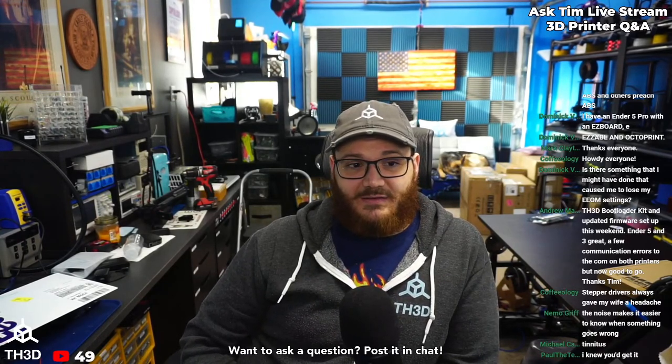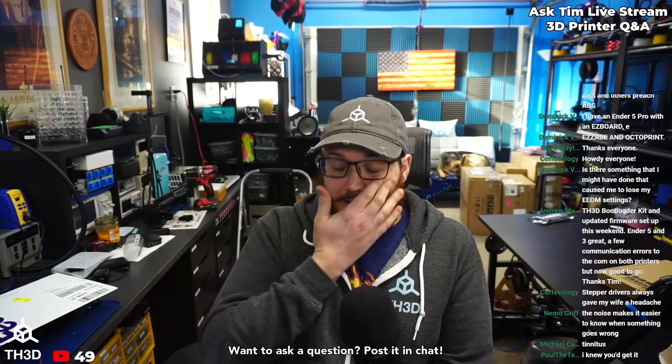V-Rich says, are 100K thermistors good for higher temps? And he's saying 300 plus C. I would say no. There are some that say they can go up to that temperature, but most 100K thermistors are going to max out around 300. So the highest I would recommend using those for is around 290, because you want to give yourself some cushion.